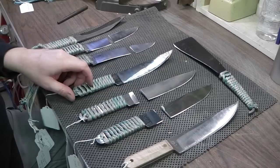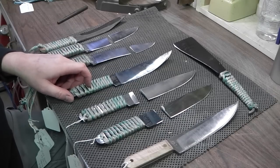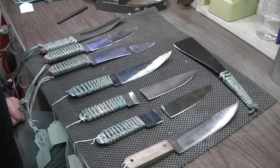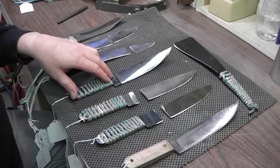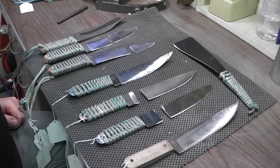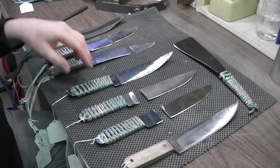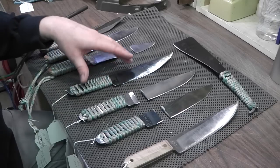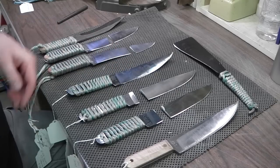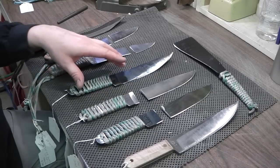And there's different grades. There's 1085, 1070, and 1060, 1050. They're mostly used for machetes and other stuff like that. But the 1095 is used pretty heavily for knives. And if it's heat treated correctly, it can be used for machetes. Now this one, the 1095, had a low temper, it flexed and didn't break. So that's what you want for a machete.